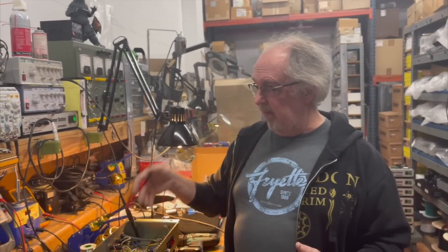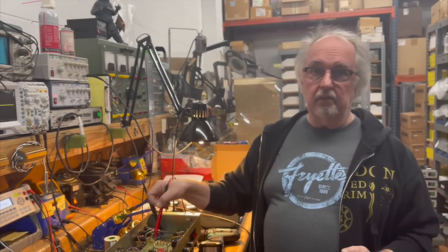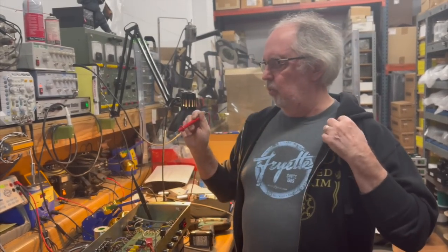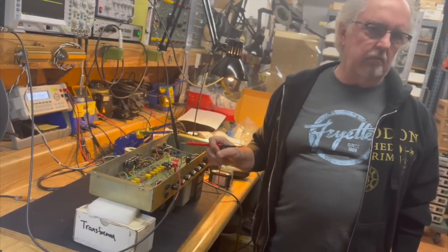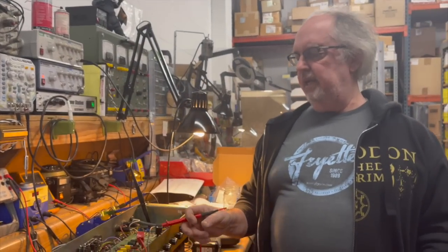So the output transformers wanted to see the impedance of an EL34 driving whatever load is reflecting back to the power tubes. And what we're seeing here is a mismatch. We're also seeing 17 watts of dissipation on a power tube that is rated at 42 watts dissipation. So that's more like 40% of total plate dissipation.